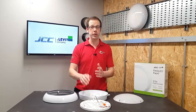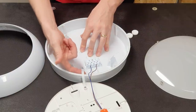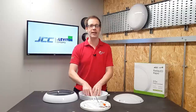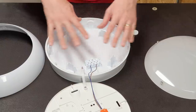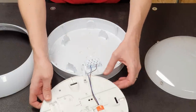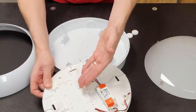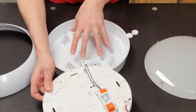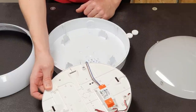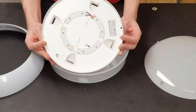During the literal seconds that you'll be making the connections in the back of the fitting, the tray has a hook and nylon strap arrangement to keep the gear tray from hitting the deck and getting damaged. Look how completely uncluttered the base is. All the driver plus any batteries, inverters, and sensors are mounted on the tray, leaving the base clear for the electrician and making it super easy if the lights need changing at some future point — as the tray can just be swapped out instead of the whole fitting.